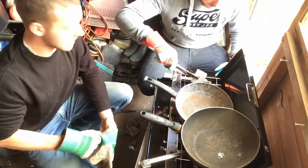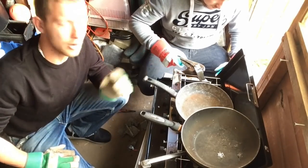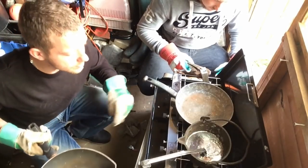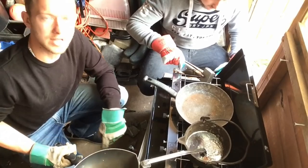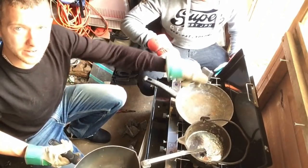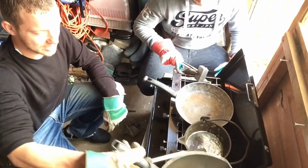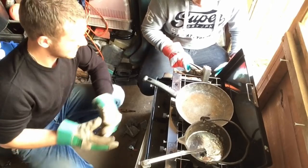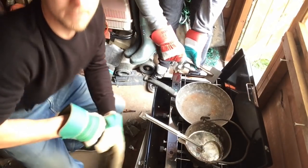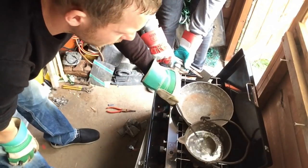Sam's just heating up the mold. You have to get your molds really hot, otherwise it just won't take properly — the first couple might not go well. We're going to wait for the ladle to heat up, and Sam's going to hold the mold over this tray and I'm going to pour in. About to pour the first one. Always remember, gloves are highly important. No water near the lead whatsoever.